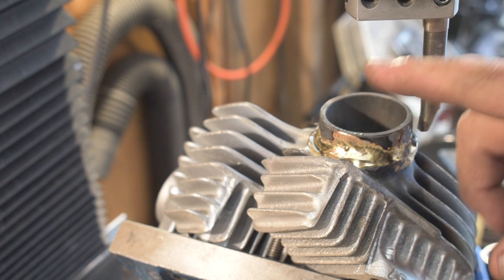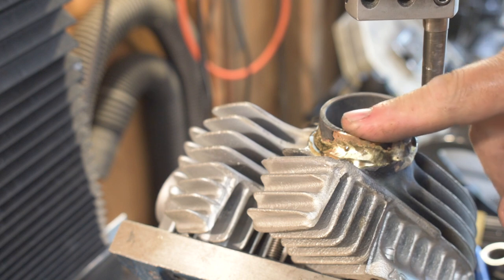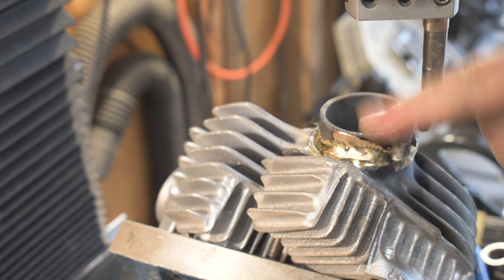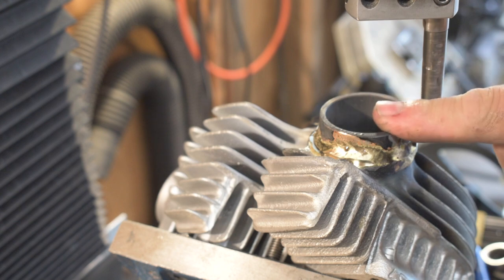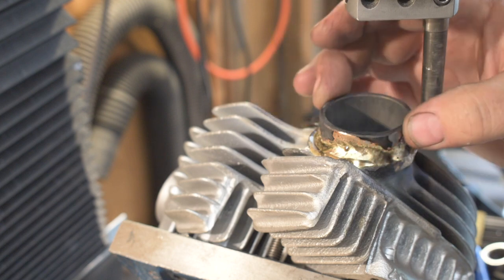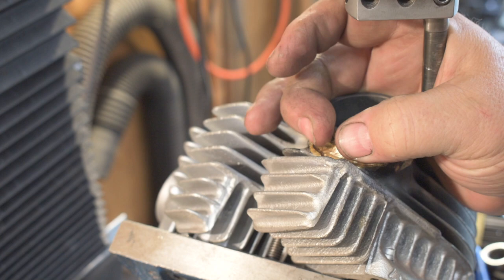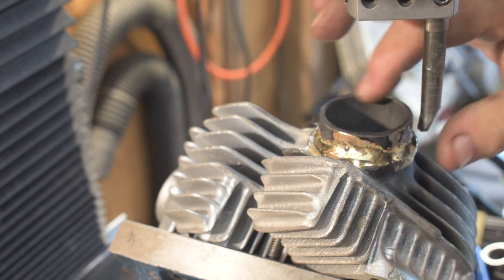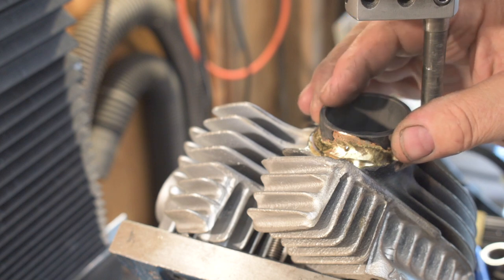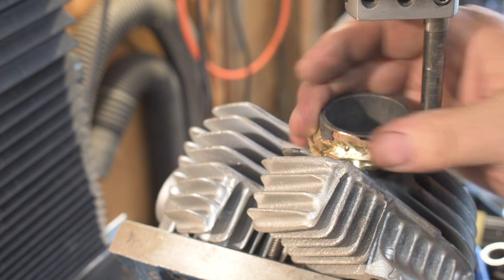And I say this was similar to another repair. Well, it's similar to the same kind of repair I do for chips on the intake side. The difference being this. On the intake side, that flange that the O-ring sits on sticking out doesn't carry any load. It just centers the O-ring. So on that one, I machine the insert to be a little bigger than the hole in the head, and it's an interference fit. So, you know, it's not carrying any weight.